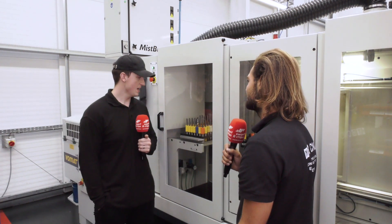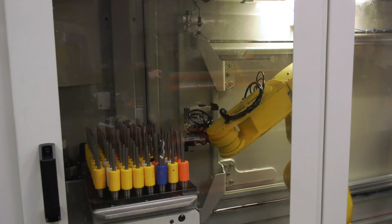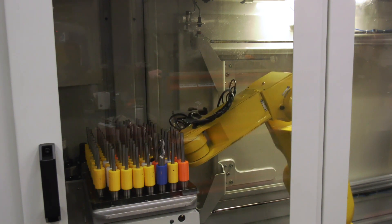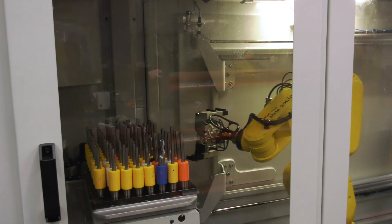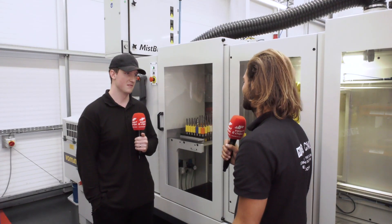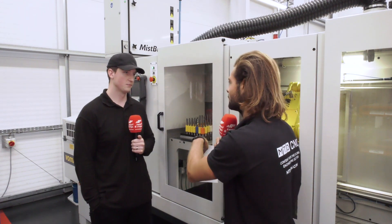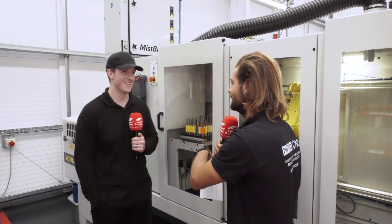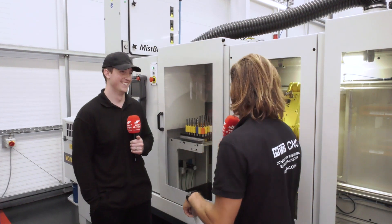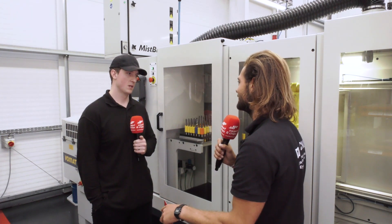Massively, yeah. As long as it's within a 24-hour period, we've got four pallets — as long as you've got one to offload, within 24 hours you can grind as many tools as you want. So you've got 88 on each pallet, that means 264 tools you can run off without anyone standing by the machine.